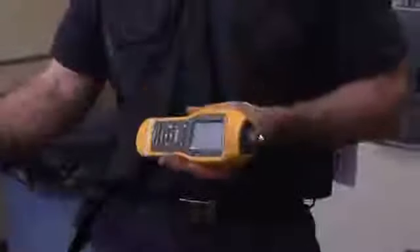It tells you the vibration — it'll give you a readout for velocity, acceleration — but it'll also give you your severity scale. It's going to tell you it's good or needs attention, that way you can schedule your downtime so you're not having any unscheduled downtime.